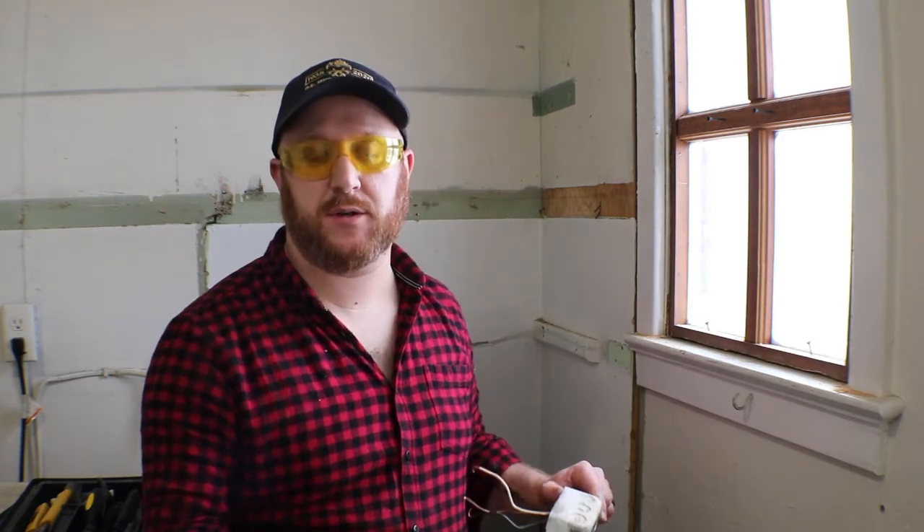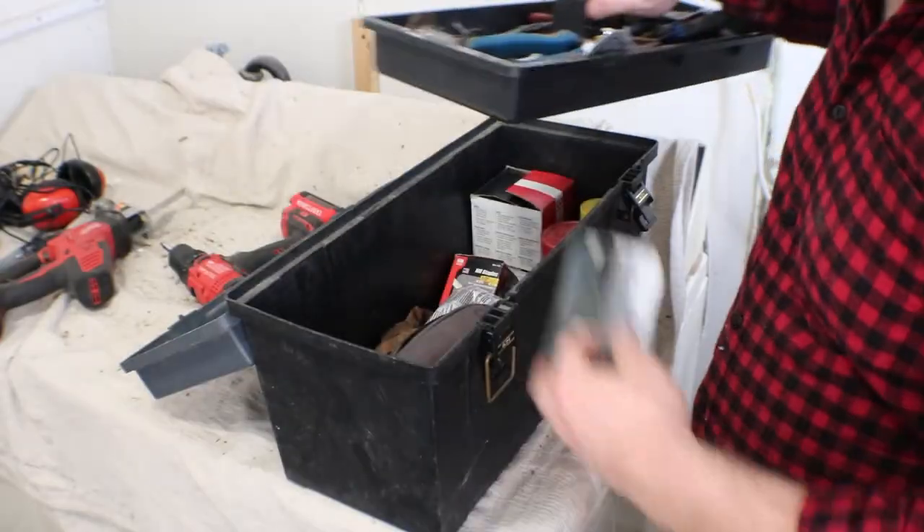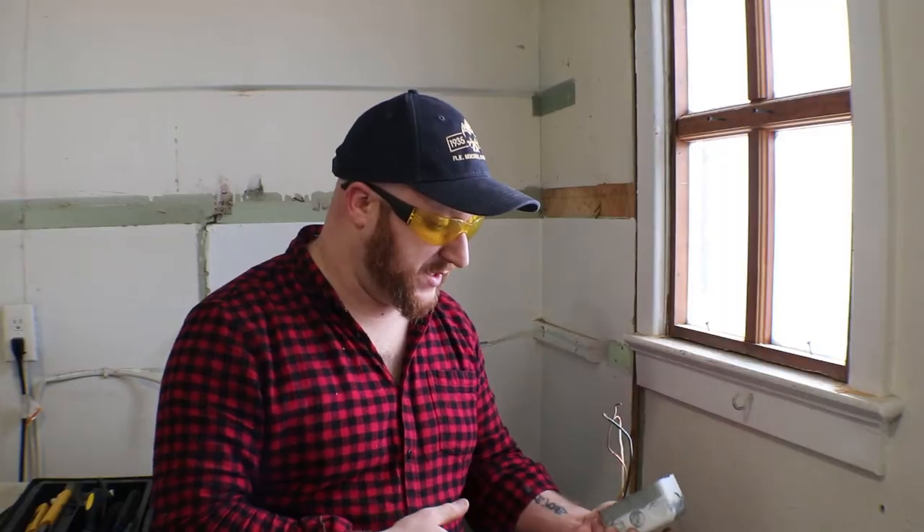Here's a little tip when you're demoing: a lot of the stuff you're taking out is going to be trash, but these metal junction boxes — the only thing that's ever really wrong with them is they might be dirty or painted, but you're going to put them somewhere you won't see anyway. What I always do is save them. You can take the wire off and just put the box in a storage box somewhere. That'll save you probably at least fifty cents to a dollar per box, and if you add that up on a job, it actually adds up to a lot more than that.